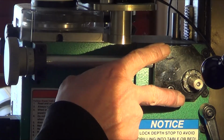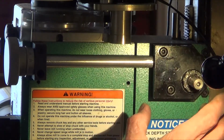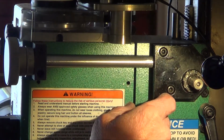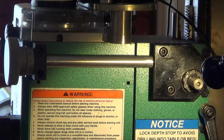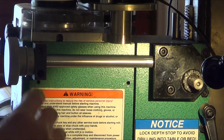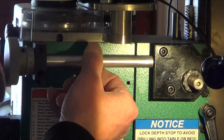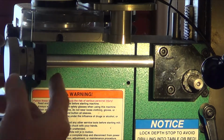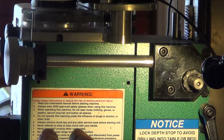First, when you tighten these down, you've got to make sure you're centered on this thing. This moves a lot, and I wound up putting it together wondering what the heck is binding. Plus I needed grease down in here. But I just machined a shaft, and you can see it just spins easily on its own. You can line it up, no problem. I've got a little bit of play this way, and these are all nice and tight, so I don't have to worry about that, but it's really nice feeling.